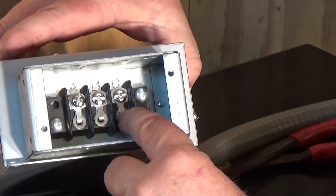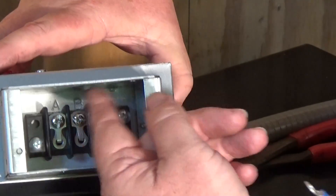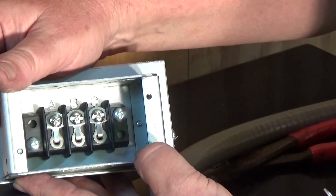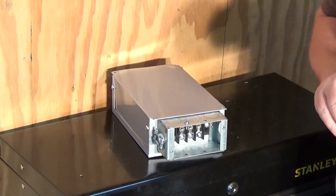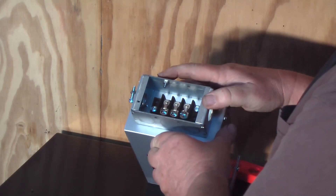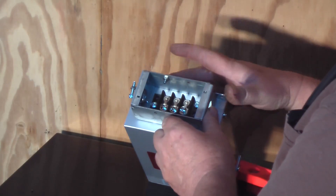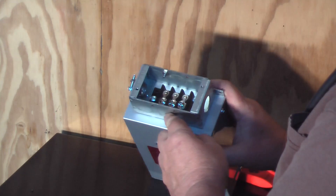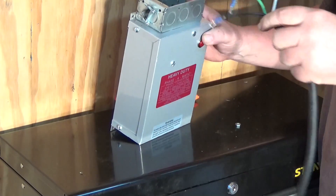You run 220 to the A and the C. Get in from the motor — A, B, C. I do have to put a grounding lug in here somewhere; I just need to ground it to this box. We'll knock these knockouts here, put our connectors in there. Installation of this is relatively simple. It did talk about having the 220 come in going to the A and C, and then the three-phase going to the motor. Didn't give you a grounding lug, so I put a bolt and a nut in there to attach my grounds to. So we're just about ready to start installing this thing, going to run this SO cord in there and clamp it down.